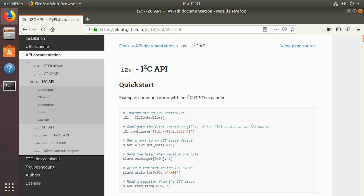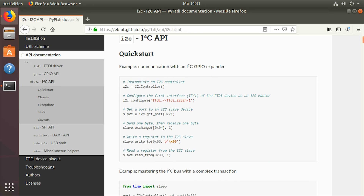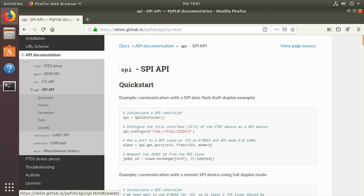From this point forward, you could write your own program to interact with the I2C bus. The documentation is pretty good and gives you examples. You can also play with the other interfaces like SPI or UART, or even bit-bang all the IOs available on the board. Everything is explained in the documentation of the API. If you're a frequent Python user, I'm sure you'll appreciate having this new way of interacting directly with the hardware.